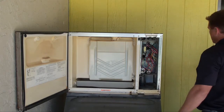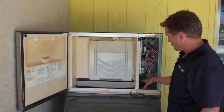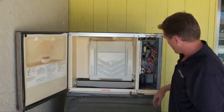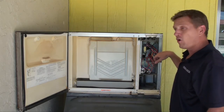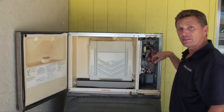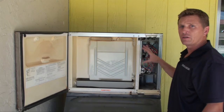Once we get our lamp mounted, we're going to be installing the power supply directly in the empty cavity and running the lamp wires directly to main line voltage so the unit is on all the time. We do not want it to cycle off and on with the system — we want the light to be on during all cycles.